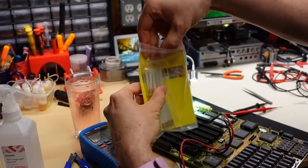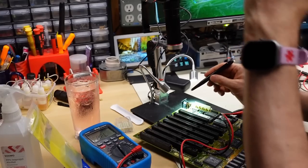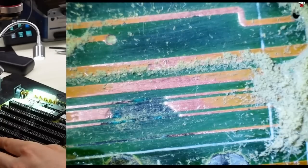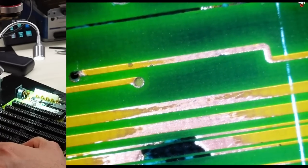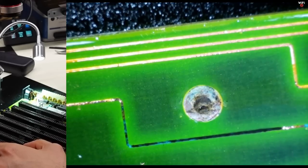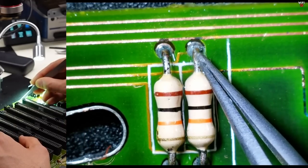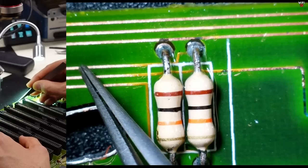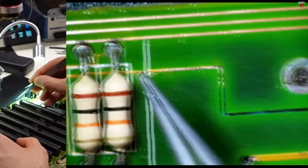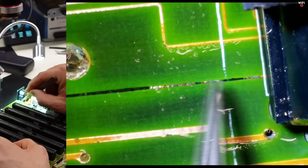I'm going to grab one of these glass fiber pens sent in by one of my lovely viewers and try to scratch or polish away some of this terrible looking stuff. After polishing, I can see very clearly where the traces are good and where they're bad. I notice that this resistor right here — see how that trace comes off of it — I think it's actually connected, but I rubbed off the solder mask in case it's not, so I can jump from right here on the resistor to right there. Then this trace here that goes underneath — that's one of the traces that's completely gone.